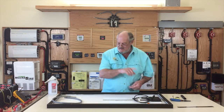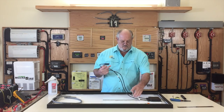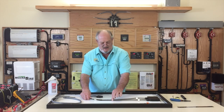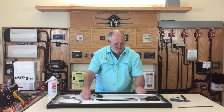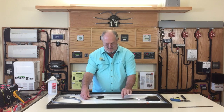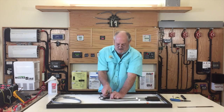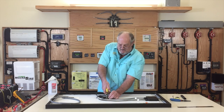So to prepare these panels to fit this wire, we have to cut the MC4 leads. We've developed a little measuring tool that we put up against the junction box. The minus cable gets cut at a mark that's two inches shorter than the positive cable. The reason for that will become clear in a moment. So I'm going to cut the negative cable right there.